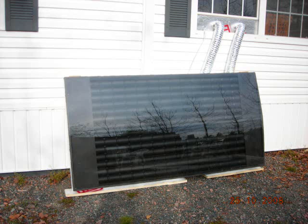The next day was cloudy as well — not a good day for testing, heavy overcast. But we did get some periods where the sun came through for 5 minutes at a time. The panel did come up to temperature, turned on the fan, and I was able to get a reading in the house in the exhaust pipe of 95 degrees Fahrenheit.